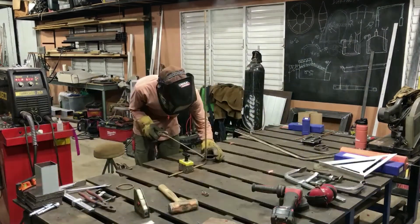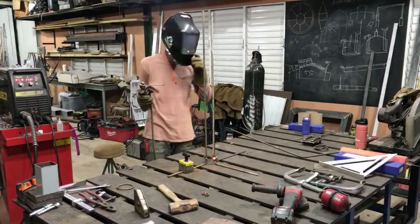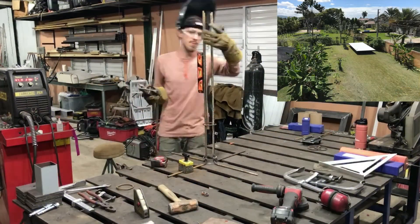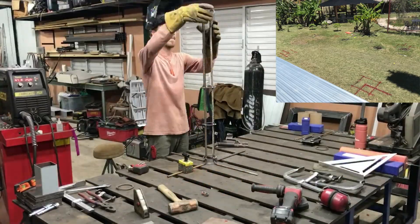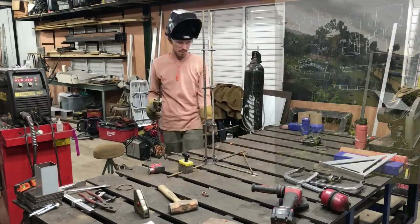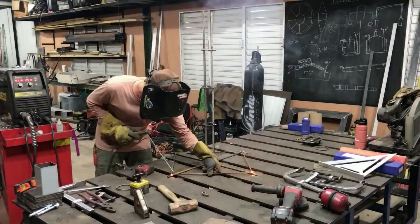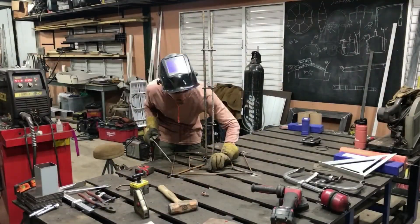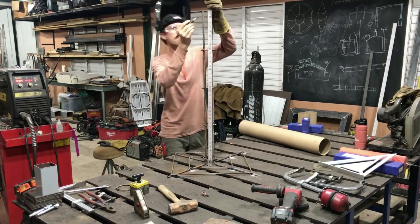Right here I'm getting started on the foundations. These are just pieces of rebar bent into L shapes, and I also bent some rings out of quarter-inch, going about every eight inches, and we're getting those all welded in place. These will carry the whole load of the house, and it's really neat because it utilizes very little material — the four foundations came out to a little over a hundred dollars finished. I'm just using shielded metal arc welding with 6013 electrodes, eighth-inch, at right around a hundred amps, which runs those quite well.